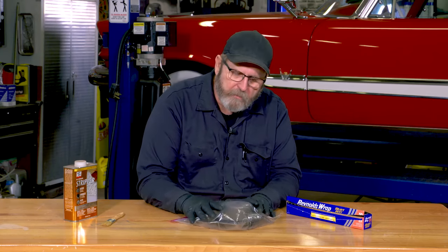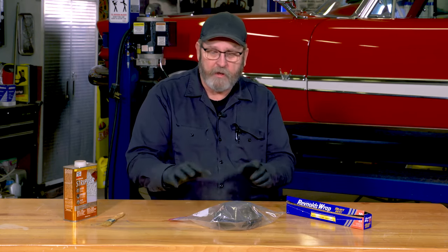The good part about putting your parts with the stripper inside the bag is now they don't dry out. That's the biggest thing you have to worry about — all the stripper drying out. So it won't dry out, plus an added benefit: you don't get that strong paint stripper odor in your shop for hours while you're doing this.